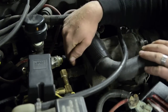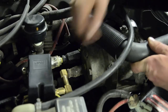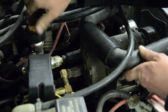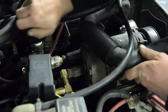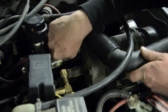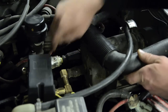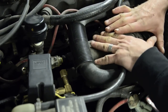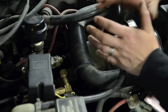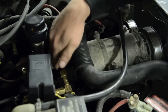That was a little bit tricky. If you can't do that, I'm sure you can take it to a welding shop. After that, pretty easy — right from the beginning of the setup: air filter, keep all that nastiness out, staged down to quarter-inch national pipe thread or MPT, went into an air oiler. On your normal air conditioning unit it's a closed system — inside the refrigerant gas there is lubricant that keeps this lubricated, it's not internally lubricated. So if you're going to do this conversion, this is a must.